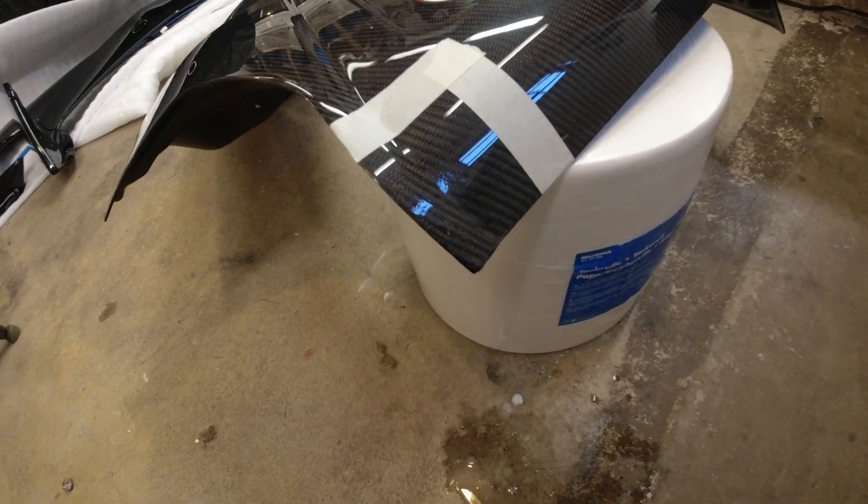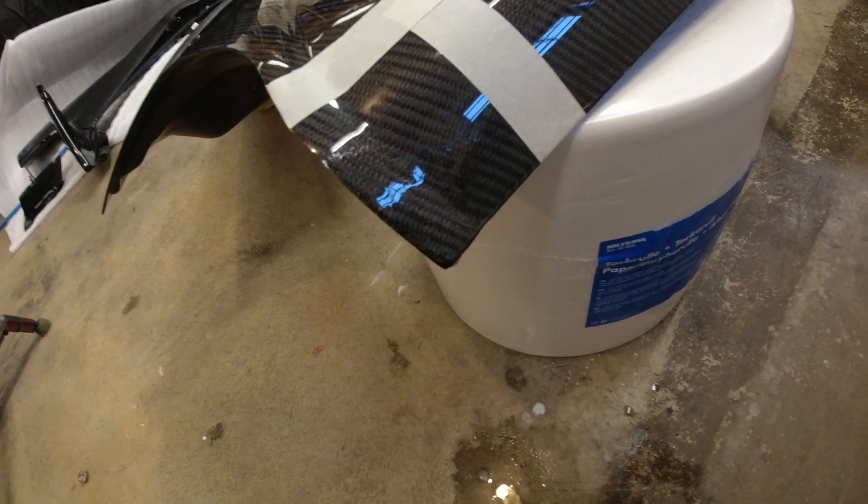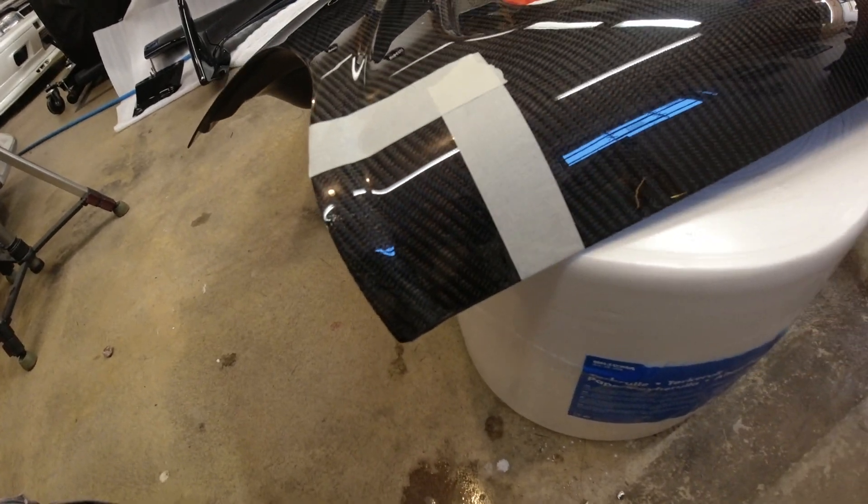So that's one coat of resin and you can see it's looking pretty good now. I'm going to go and add two more coats of resin and then we'll come back when it's all cured so we can do the sanding. It's important to add a few coats of resin — nothing too thick though — so that it's a bit proud and you can sand it all back flat so the whole area is all the same sort of height.